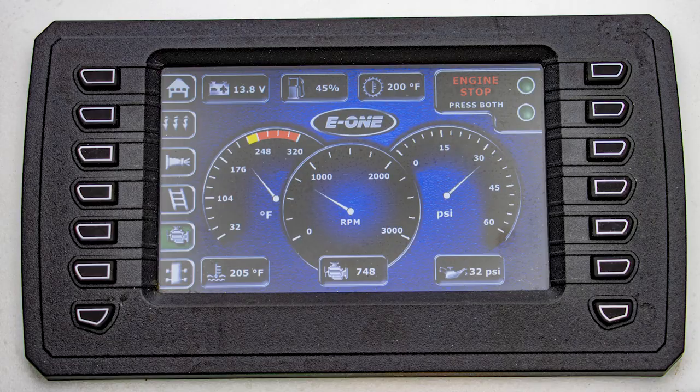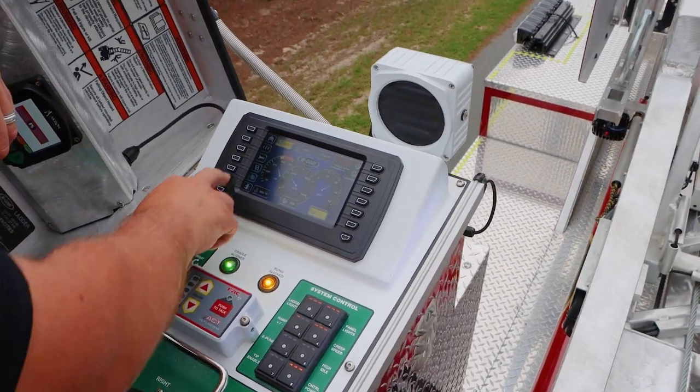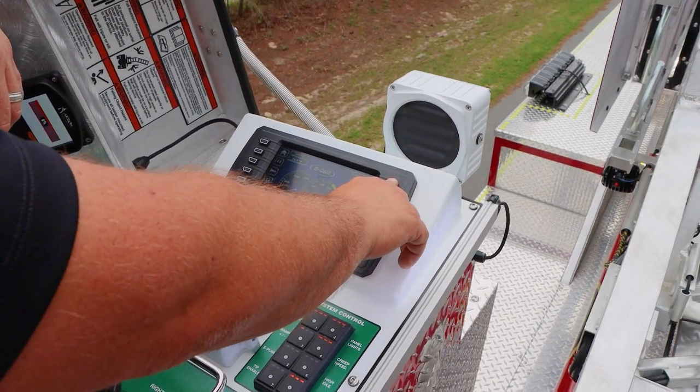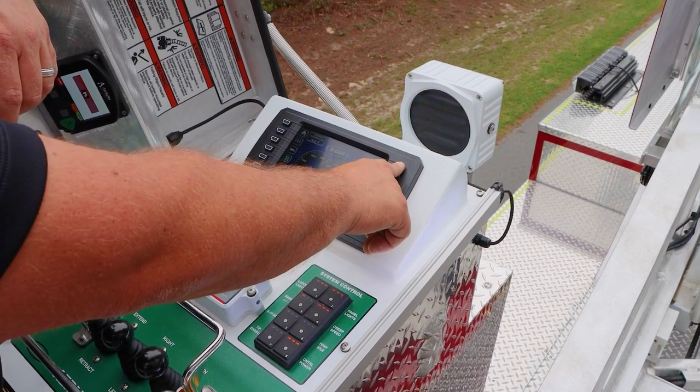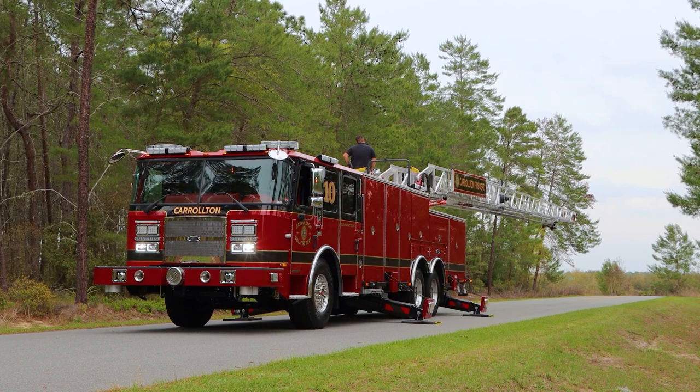Going back, we're all done with the engine off. When you have two red lights, you press both two buttons together and the engine fires up. Go over to your ladder screen, turn your aerial PTO back on by holding it for the same amount of time, and you're ready to fly. That's it for our Advanced Aerial Control System Deluxe walk-around video. We just wanted to show you all the features — there's a ton of information in this system, really beneficial on the fire ground and for maintenance aspects of the truck. If you have any questions on this, please reach out to any of your E1 dealers and we'll be glad to serve you. Thank you.